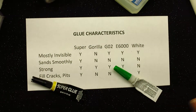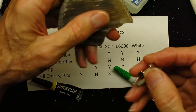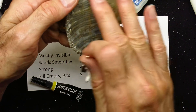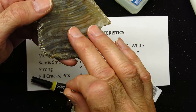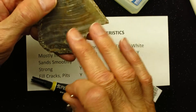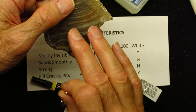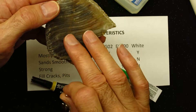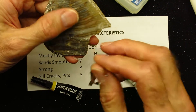The next example is if you want to glue an object to the stone. First thing you want to do is some surface preparation — you want to be sure that the stone is nice and clean and dry. To do that, I usually use cat litter, baking soda, flour, or anything similar. Just put it in and leave it for several days or a week or two to be sure you get all the oil removed from the cutting process. Then you can brush it under running water, air dry it, and you're ready to put your glue on.